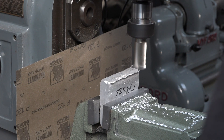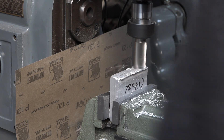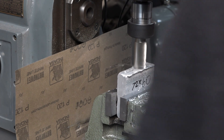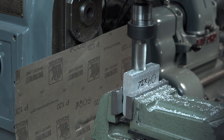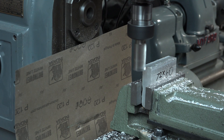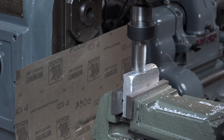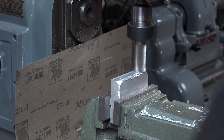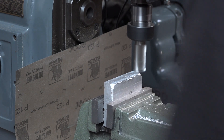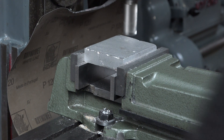I'm going to size it now and get these sides trimmed down, just again slightly oversized. These are about 1.5mm cuts with this 20-odd mm cutter. I could take more — this mill will probably cut five millimetres off this block — but if you take smaller passes you just get a better finish. This is the last fine finishing pass. I then turned it round and took two millimetres off that side in two passes to clean it up and get a decent finish. I love this mill — it just doesn't phase it whatsoever, so rigid.